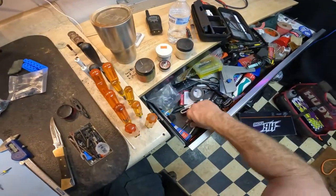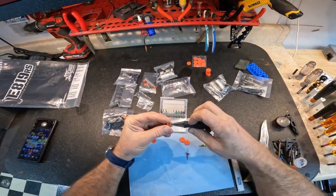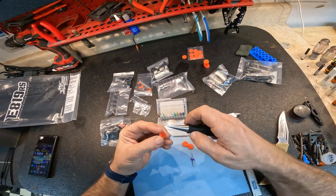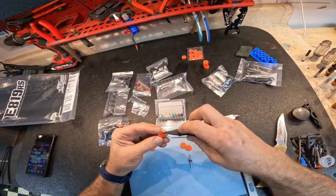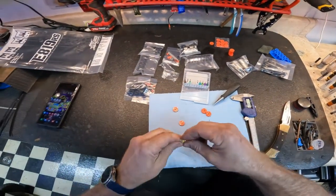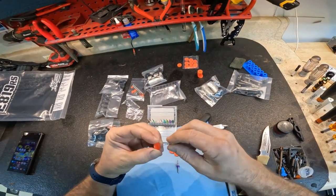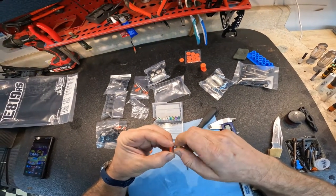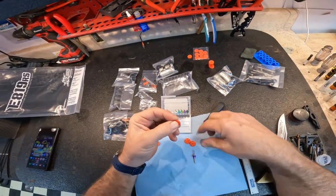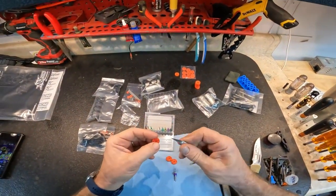Okay, so you drill those that way, and then I like to take a body reaming tool and just clean off any burrs real easy. Don't want to change the shape of it. I'll run it back through there, and there's little pieces in there. It kind of cleans it out. Wouldn't hurt to take an air blower and blow them out. Got any little pieces, you can pick it out with a razor knife.